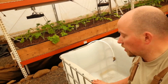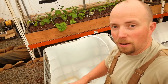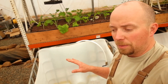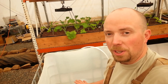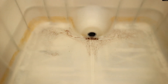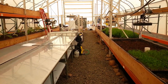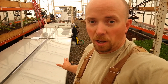The first station here is actually the last one used in the process — this is the cleaning station. It's just an IBC tote with the top cut out and the drain in the back. We put all the containers and trays that the microgreens are growing in here, then pressure wash them off and the water and dirt drains out through the bottom. There's the pressure washer — it's an electric pressure washer that draws 14 amps at full pressure.